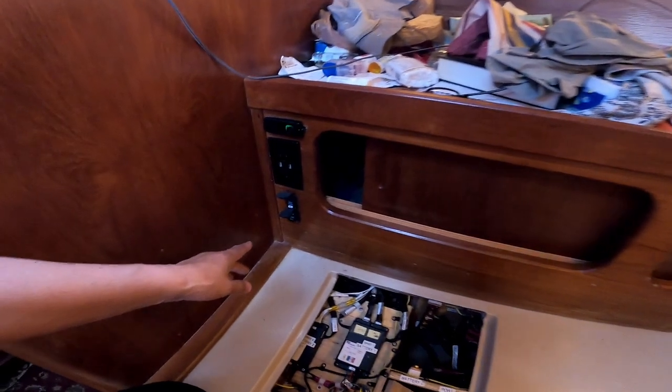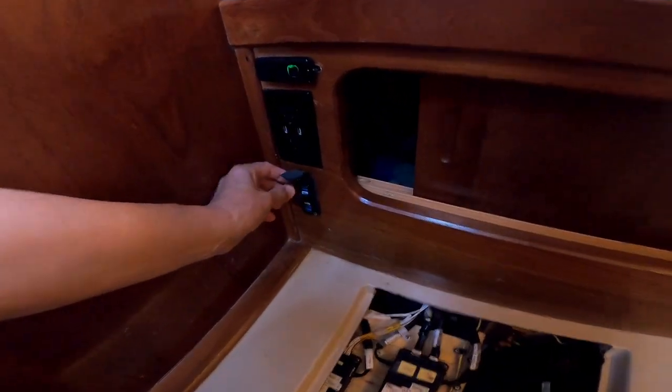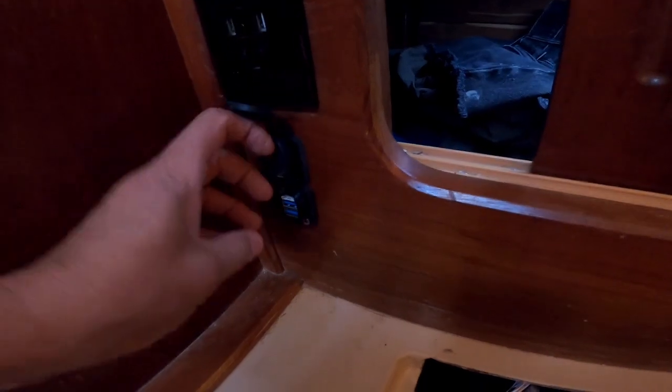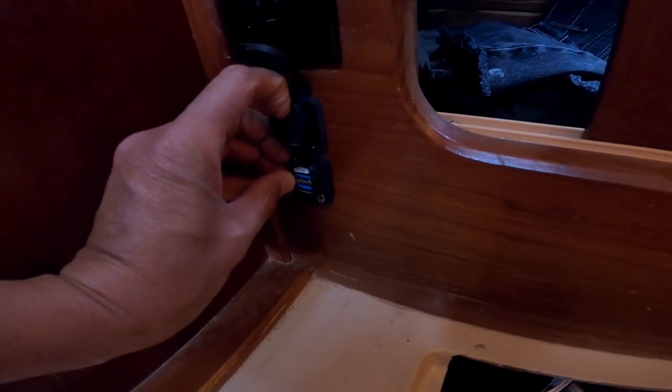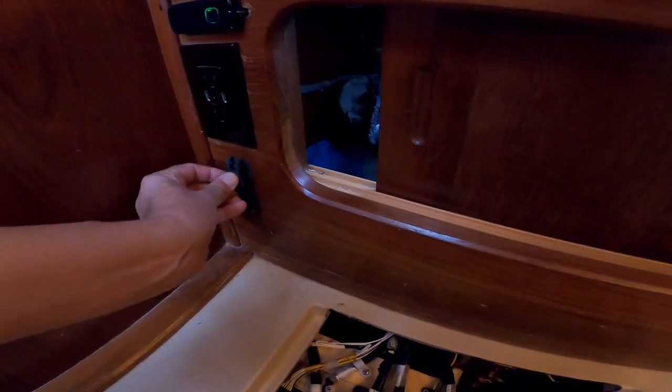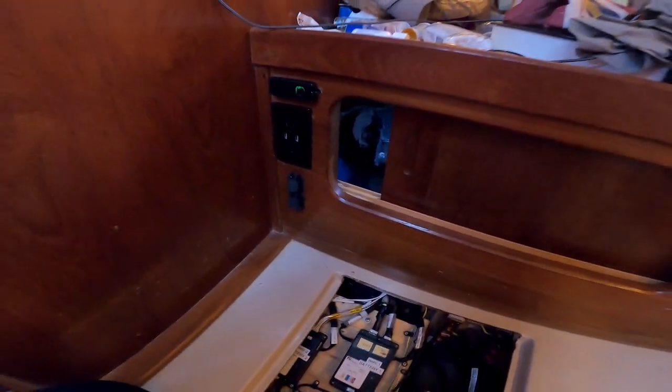We are able to talk with the battery management systems through 2 USB ports that we have set up to talk to BMS1 and BMS2, and the 2 charge controllers we can access through USB ports here to bring up a terminal and to be able to talk with the charge controllers or with the battery management systems.